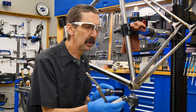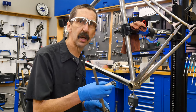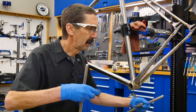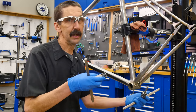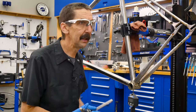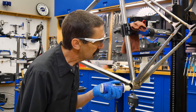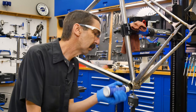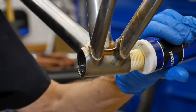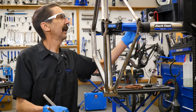The skip tooth — see how there's every other tooth with a big white space — gives the junk somewhere to go when we're cutting. The taper lets us start in together so we're all square and straight. We are lacking one thing and that's going to be oil. We need our cutting fluid CF1, and we're going to get a good squirt in here as well as on the tools. Smoother threads reduce wear on the tool as well. So inside and on the tools — let it wrap.